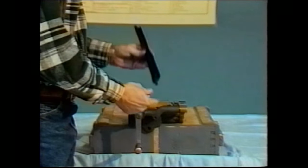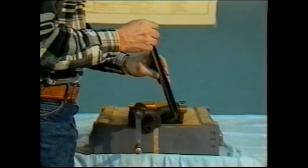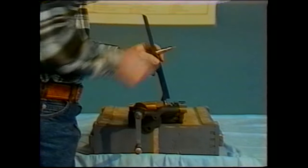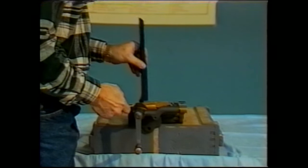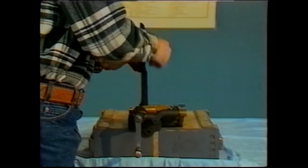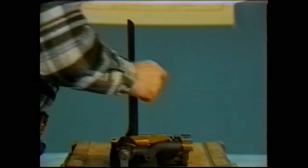There is a feed strip on the top of the machine. The feed strip is grooved. Into the grooves, the cartridges will slide. They have to be placed in such a way that they will slide down but will not pull forward. When you put the belt feed, or the cartridge feed, on top of the machine, you can then drop the cartridges down into the slot into the machine.